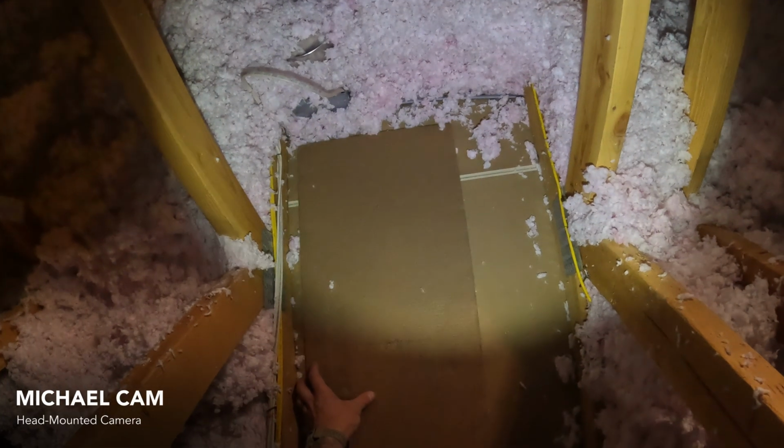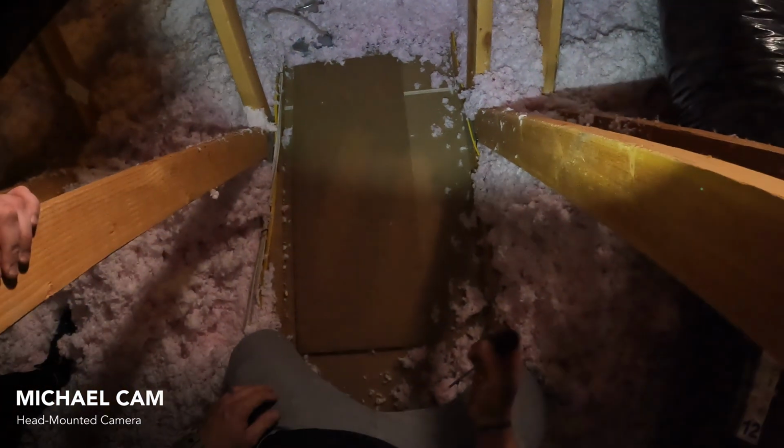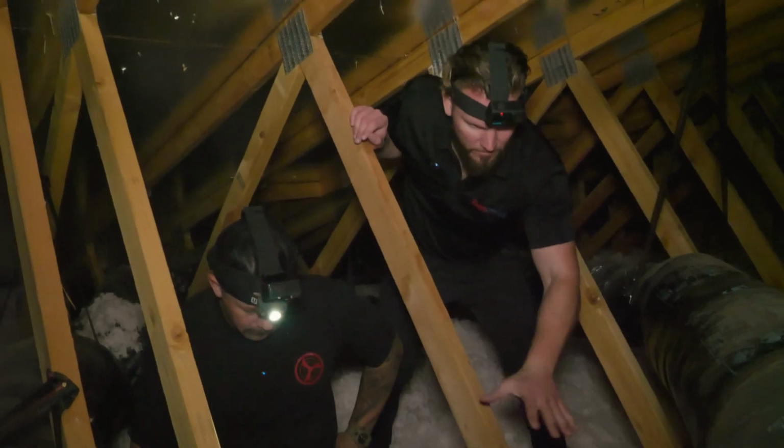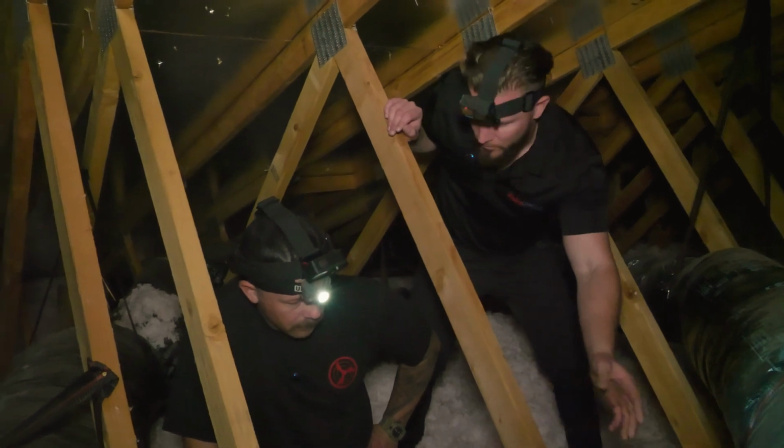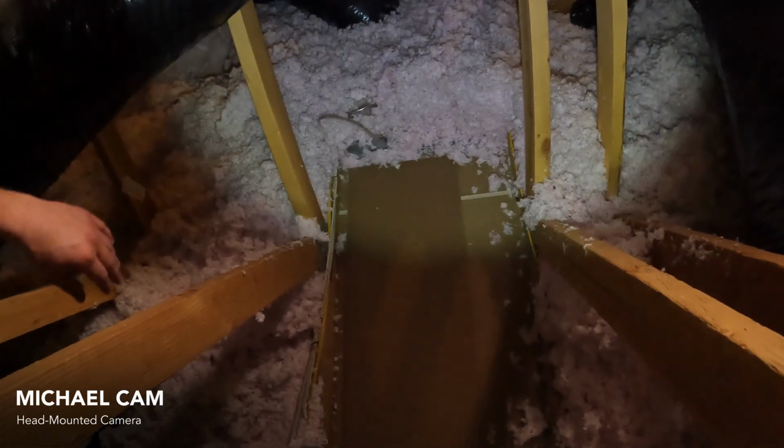And then from the house side, I'll square it up in the hallway, make sure it's square to the hall. So you made a pilot hole, and then we'll reconnect downstairs to be able to straighten it out. Yep. Okay, Michael, so we're taking into consideration where we can fit the damper box as it relates to items running in the attic and joist spacing.